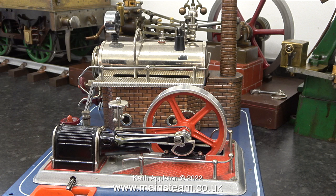These small steam toys get very hot, more than hot enough to burn your fingers, but because they run on low pressure steam — around about 15 pounds per square inch — the steam temperature is much less than a steam plant running at 80 to 100 pounds per square inch. The higher the pressure, the higher the temperature. The principles are identical on the small ones to the larger ones, but the management of them is very different.